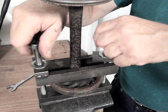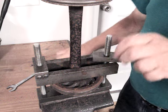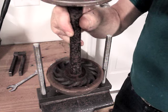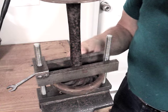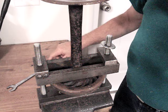Once I've successfully done that, all I have to do is take the fixture back apart, take the axle out, turn it over, and do the other wheel. It doesn't take long at all to take the fixture apart. Then it goes back together exactly like it came apart — put the fixture back together, put your two washers on, put your two nuts on, and tighten the assembly.